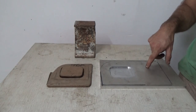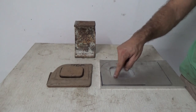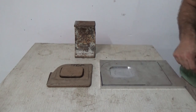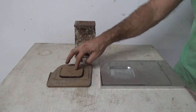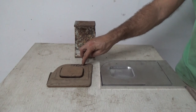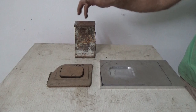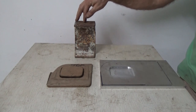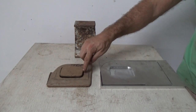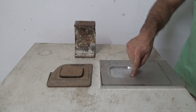Here we have the components we will use to form the recess. This is the bottom mold with a nest we made on the milling machine — I used a ball nose end mill just to have a nice radius on the inside. This is the puck that will press the recess into place on the top part. This wooden spacer here will keep the sides of the metal from creasing. And this nice crusty piece of I-beam will be used to apply the pressure. The puck has a piece of saw blade bent around it like a hacksaw blade, which will give a sharp corner when we press inside the form.